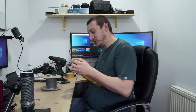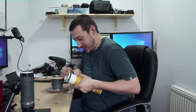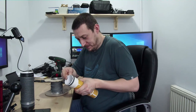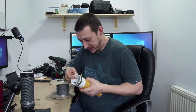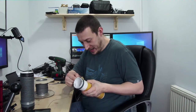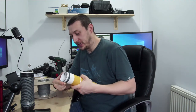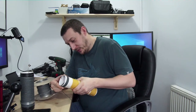It's literally just a case of keep going. I'm sure you don't want to watch me do this non-stop so I'll edit this bit out. The trick — and it's fairly critical — is to keep it tight and close together, keep it looking neat. You can see what I'm doing here, working my way around, slowly adding it on, nice and tight. This wire isn't the nicest to work with, but I do like to use it for outdoor antennas because it's electric fence wire — it's tough, you can put it under a lot of tension, it won't break, and it's designed to be weather resistant.